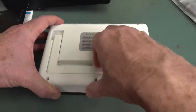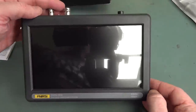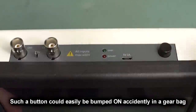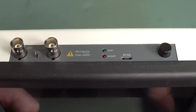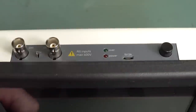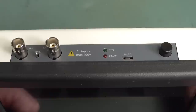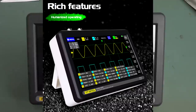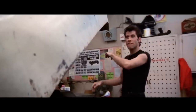It's not a bad form factor — nice and neat, fits on the bench. The probes come out the top which would have been better on the side. On top there's a power switch, a micro USB — would have preferred USB-C — and a 1kHz test signal for compensating x10 probes. Just two inputs, no probe detection of course at $140. It comes with two switchable x1/x10 probes supposedly rated at 100MHz. $140 delivered with probes — wow.